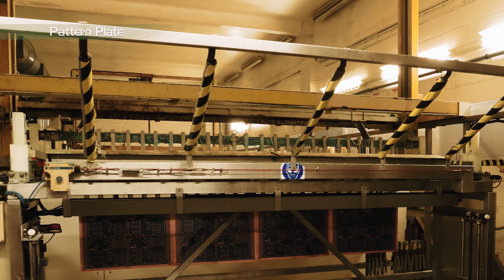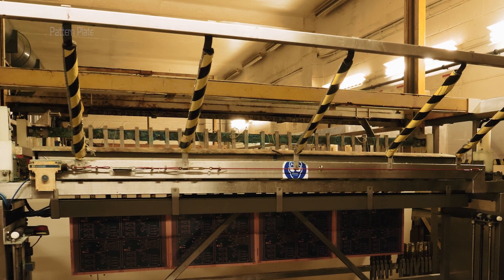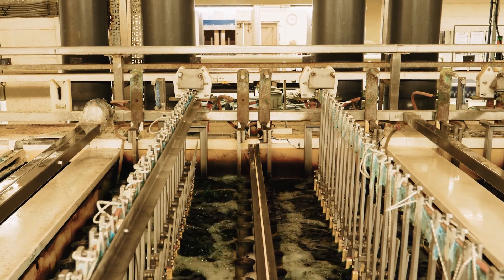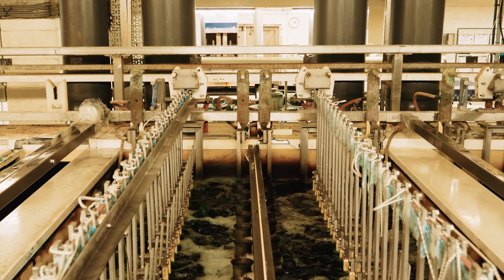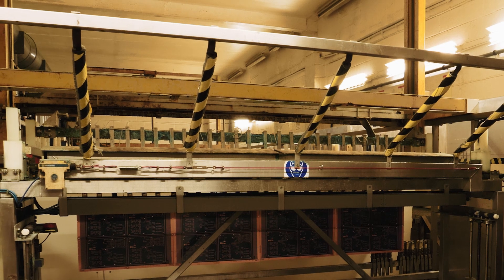The copper plating is deposited electrolytically on areas without resist and within the vias, to create connections between the inner layers. The panel is placed in the plating solution and acts as the cathode side of the plating cell, attracting the copper when an electrical current is applied.